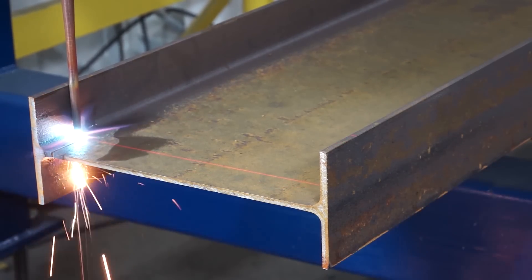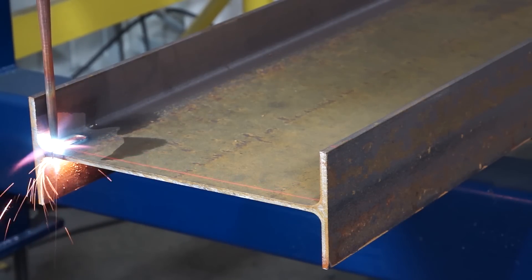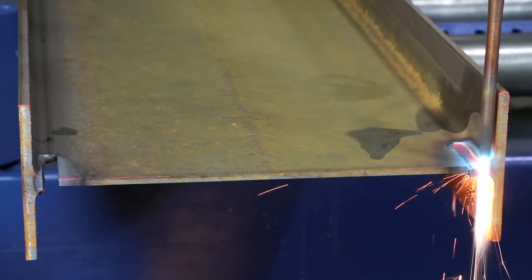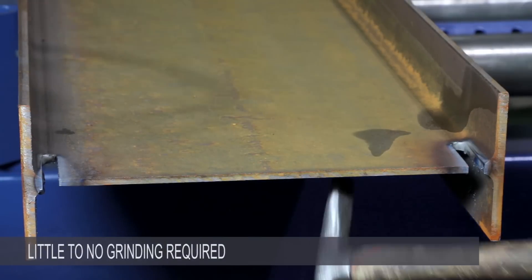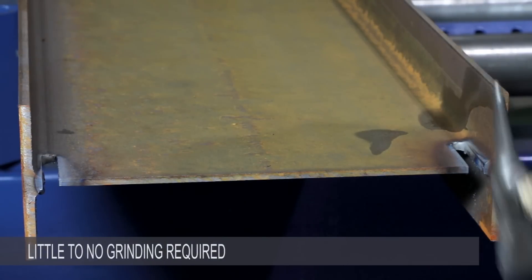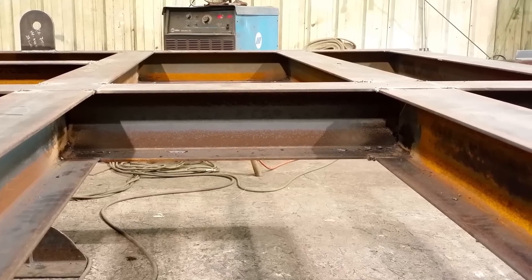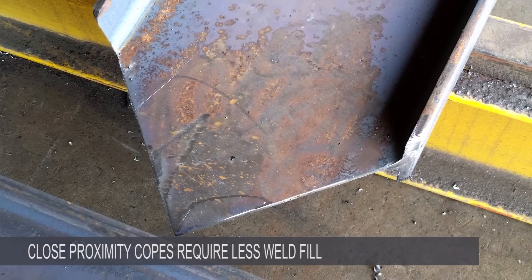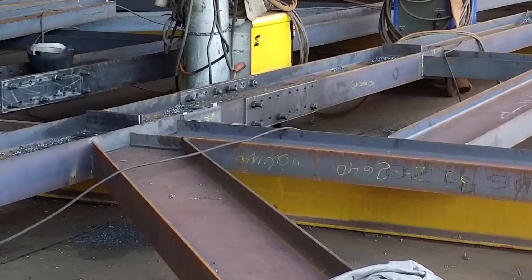The operator has manual override to adjust the cutting speed. With the correct gas adjustment and tip clearance, the quality of the cut is far superior to a cope done manually and easily rivals the quality of a plasma cope, requiring very little grinding, if any, saving significant non-value-added man-hours. When welding skids and platforms, the tight, clean, close proximity copes done by the Liberator require substantially less weld fill, resulting in additional man-hour savings.